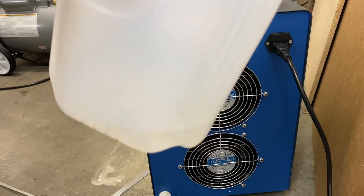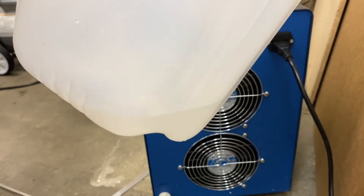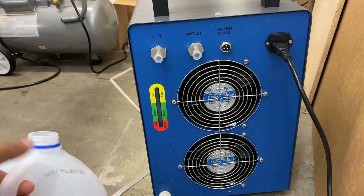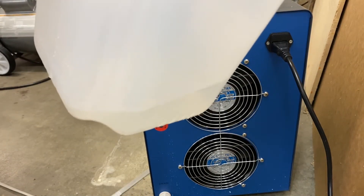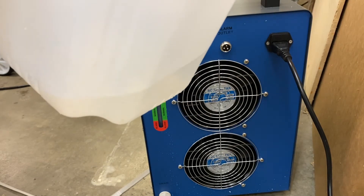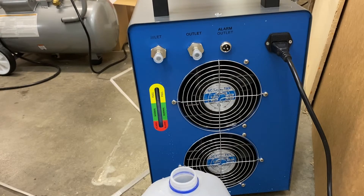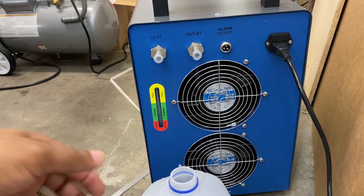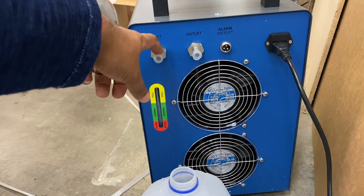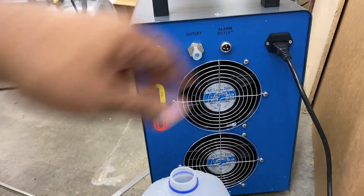When it's all done, you should have a decent amount of water drained from the laser — aside from what spills. Anything less than what that looks like, it's probably not fully drained. You should actually be able to see it in the laser as well, watching the tube drain. The inlet gives you a little bit, but mainly the outlet is where all the water flows through.